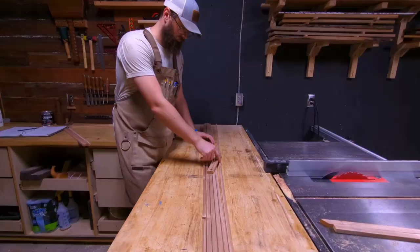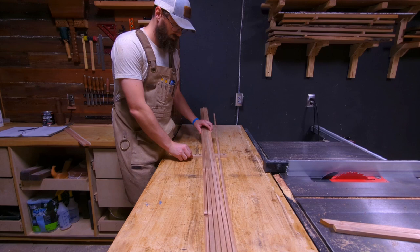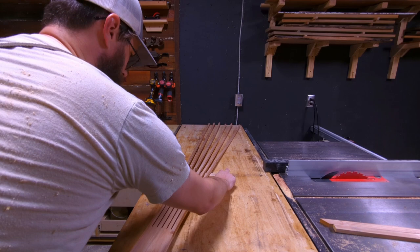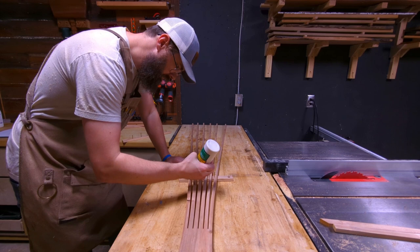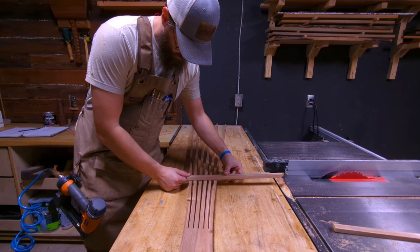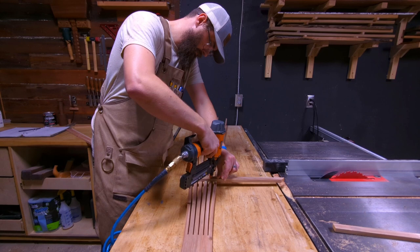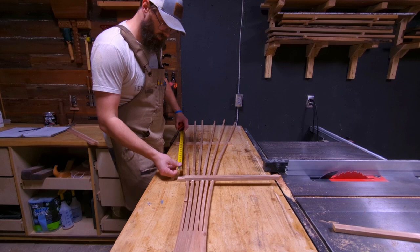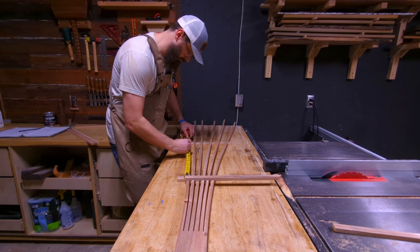This is a little jig I made from the first one I built. I used some spacer blocks in my first trellis — I set this board underneath and put the screws where the gaps happen to fall, and it's really just done until it looks good. There's no specific gap between each board; I did it until it looked mostly even, glued it, nailed it in place, and then made a jig before taking everything apart. I only have two jigs: one for the bottom, and this other one that fans out the top. Be careful when sliding it down — especially the first one — because it will split the wood if you go too far.